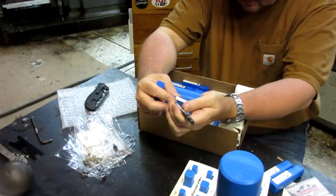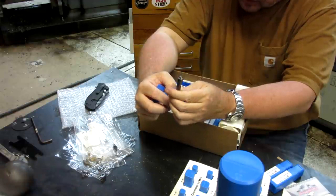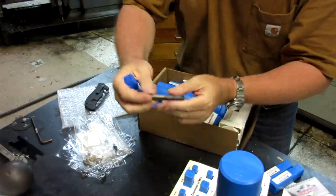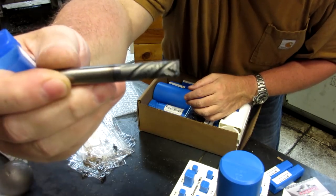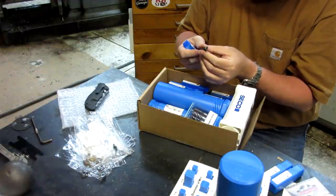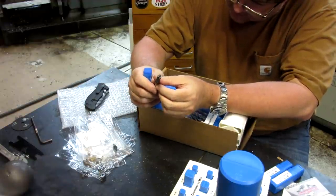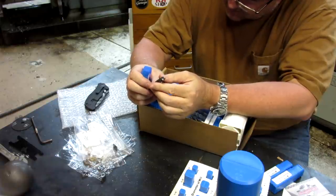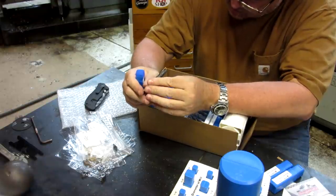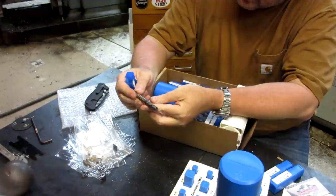Right hand, 30 degree, 3/8 of an inch, rougher with a three flute with a very interesting grind on the end here. I want you to take a look at this. Very interesting grind. Reminds me of some of the unusual grinds you see in CNC routers, like up cut, down cut, two flute bits for cutting. It's always just fascinating, just thinking about the machinery used to grind these creative tools.